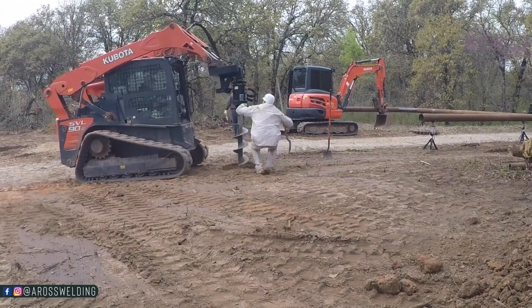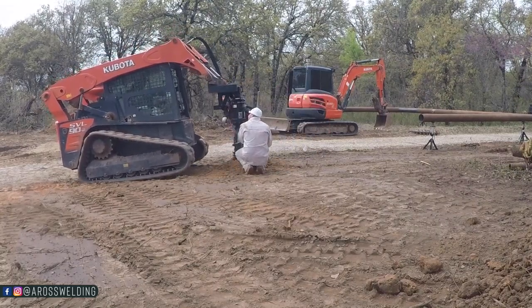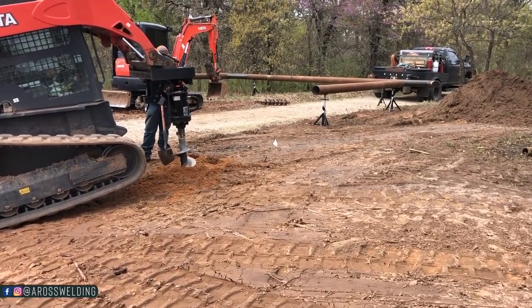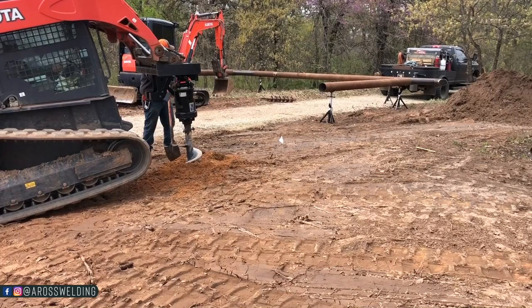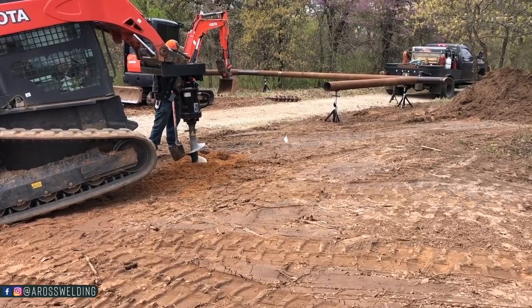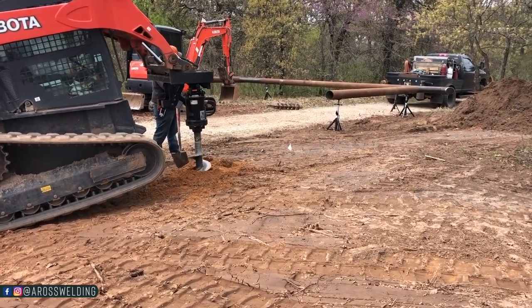We definitely got 5 foot on the main 8-inch entryway, and that's actually what I was planning on because my uprights are 20 foot to the bottom of the 8-inch horizontal at the top, and so that leaves us with a 15 foot high opening, which is more than enough for the majority of things that will be coming in and out of this entryway.